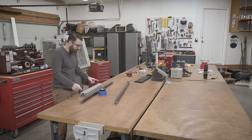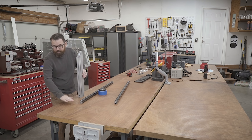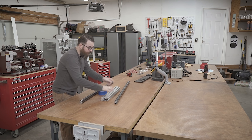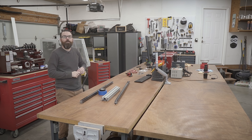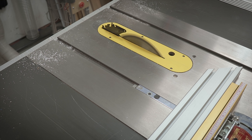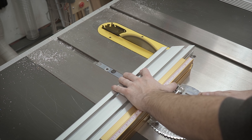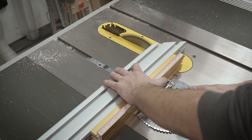Let's get started by cutting the extrusions down to a 19 inch length, which will give me about an 18 inch rise off of the workbench since they're going to be mounted underneath-ish. I only have enough for three right now; I'm going to start with these two workbenches and see how I feel about it. I've discussed this before in previous videos — if I want a simple straight cut and don't want to clean it up much, the table saw is a really good choice.